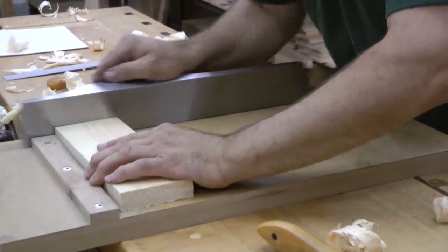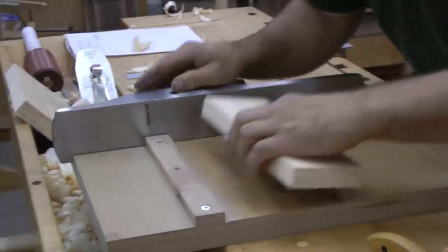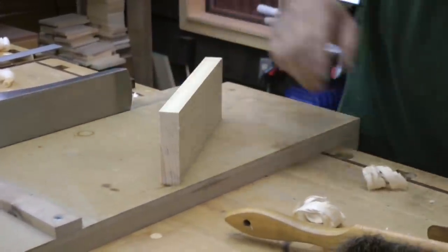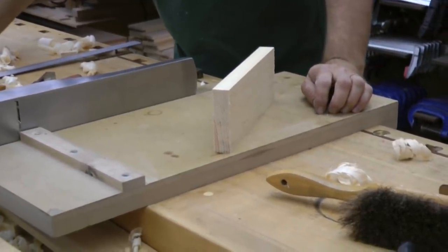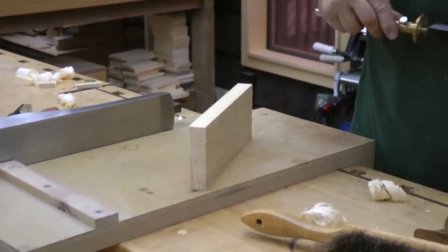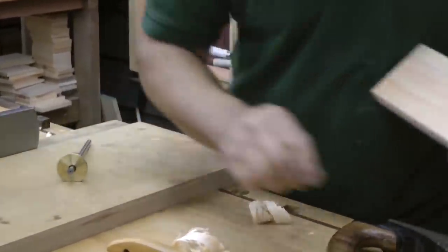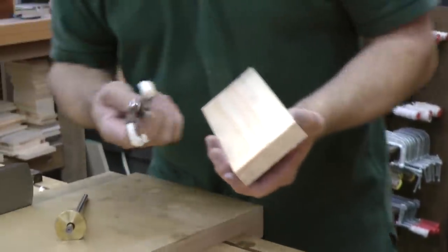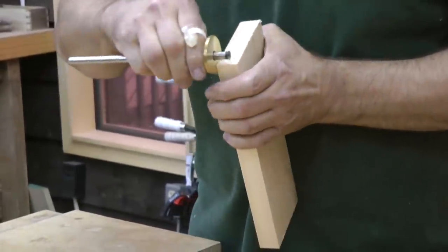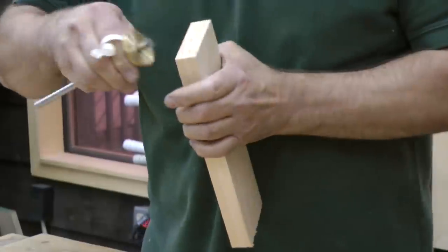Let me square up one end. How are we doing for time? 30 seconds — it's almost over. Alright, that one's squared up. Now this thickness is going to be 5 eighths on these ends, so I'll set my marking gauge for 5 eighths, and then we'll wrap it up until our next session. Scribe referencing off of the inside face — I'll label that as my reference side. I find it always easier to control a marking gauge pulling it as opposed to pushing it. I really like the wheel type because when you get right to that end, you can simply just roll the last little bit — it gives you lots of control.